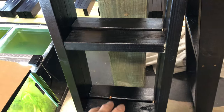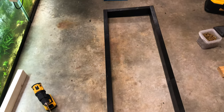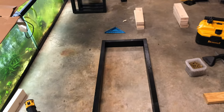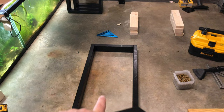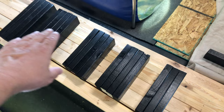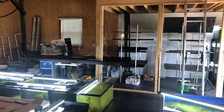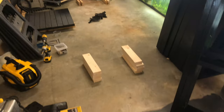If you naturally flush and plumb it up, it'll square itself. I put a T in the top right corner so I know where these will line up and which side is flush and plumb. I did have one super wonky — but as long as you're flush and plumb at the top and sides you can fix it on the legs going up. For 40s or 75s per rack, this is how many side pieces you need: 11, 13, 8, 6s — that's for one rack with five shelves.